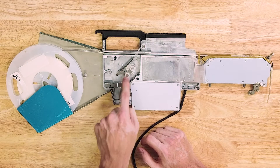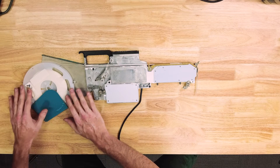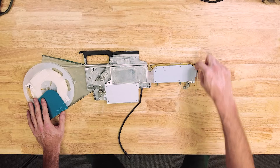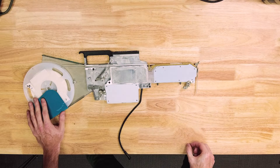You can always do a good visual check by looking at this tensioner spring. Other things to watch out for: make sure the reel is sitting firmly within the holder, and make sure this waste tape is ejecting cleanly down. As the tape advances, this spent part is ejected straight down.